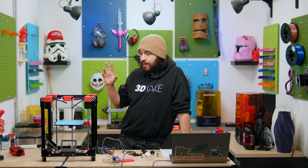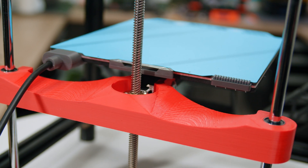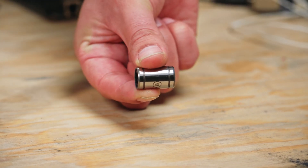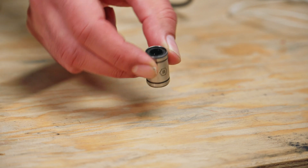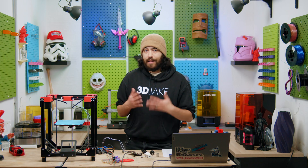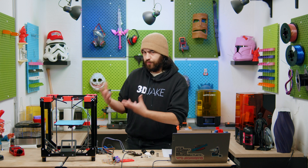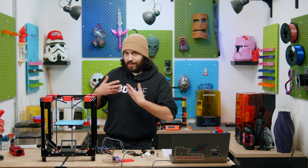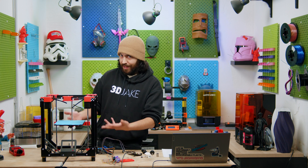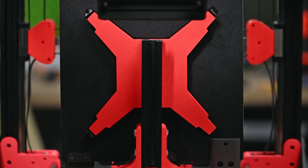There are concerns though. The problems are not really with the components we're using, they're with my design. Looking at the bed mount, at the back we have our LM8UU bearings - they're great, cheap, perform well, and easy to design around. You could also use linear rails but there is a price concern; these bearings are five euro and the rods can cost about 10 euro for a pair, while decent linear rails will probably cost twice as much. Cantilever designs are obviously not as stable as something you might see in a larger printer like an X1 or K1, which usually go for a three lead screw and three rod approach. The problem I'm having is that with a cantilever design all of the weight and force goes on one side, so that needs to be quite strong and rigid - and my design does not account for this. There is a problem where the screws go into the profile supporting the bed, and that needs to be reinforced quite a bit.